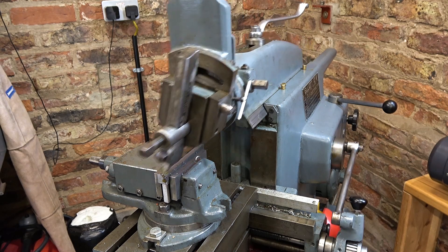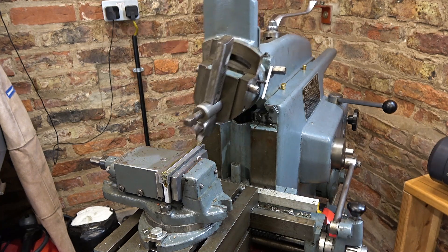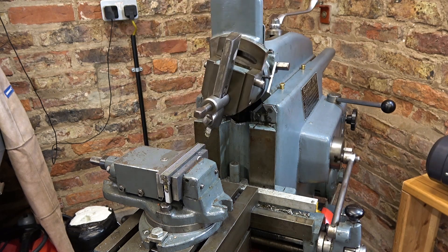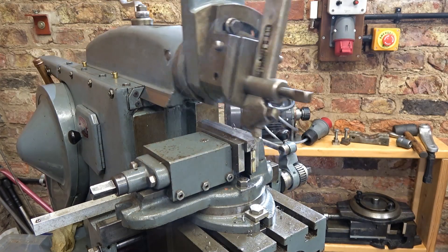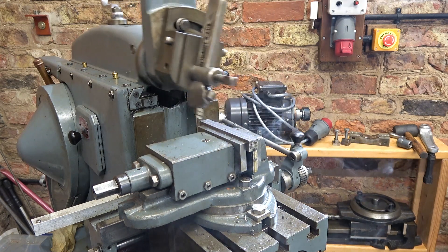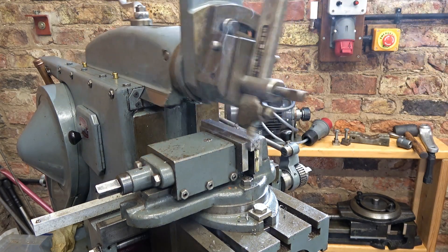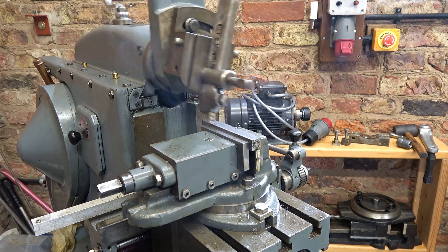This shaper is really quiet now since I made those improvements — did it in a series of videos you probably saw. So just taking about three millimetres off this and that block will act as a spacer. Cut in two — one side, other side. I'm hoping this block doesn't push out because it's not a particularly strong vice — that's about 0.3 of a millimetre cut. I don't think I'll take it any more aggressive than that with that particular vice, not when we're cutting this way. Plenty of chips going on the floor.